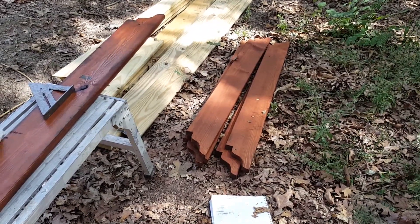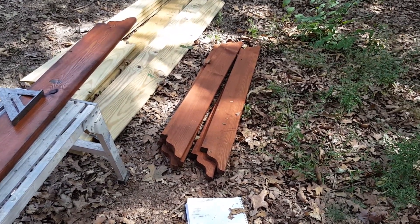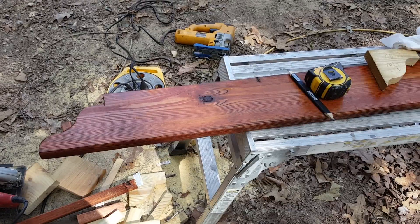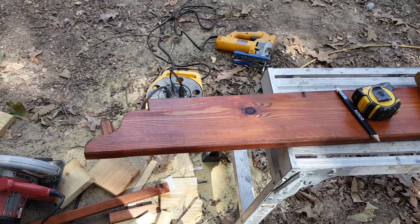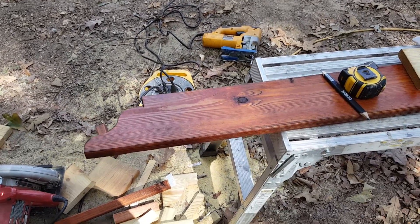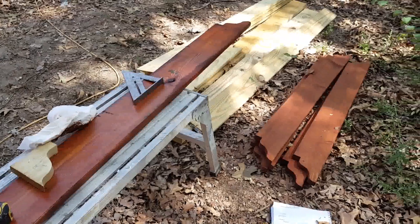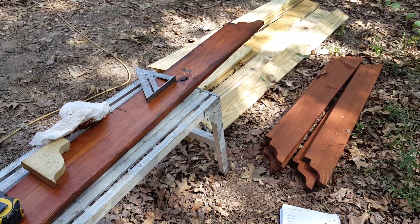You can see the five pieces that are going to go on top on the shallower 36-inch section plus the four-by-four area. The long ones going transversally — there are four of them — and I'm marking where the notches are going to go. This piece will come out just a little bit past the post; you don't want it ending right at the post. The notches are going to be inch-and-a-half deep with five of them. I'm going to stand up all four pieces at the same time and make the cuts so they all line up — four cuts in one shot.